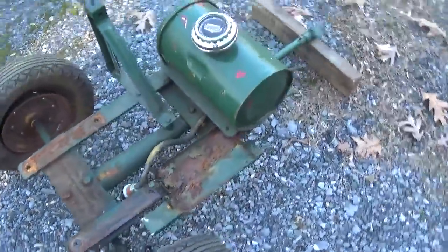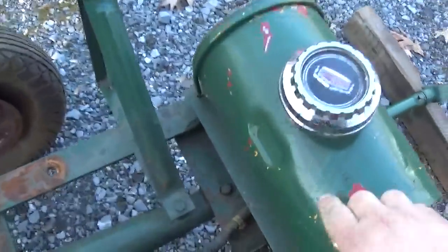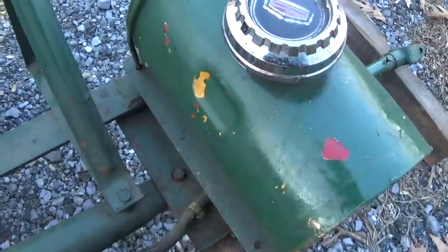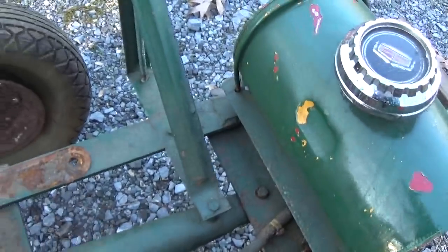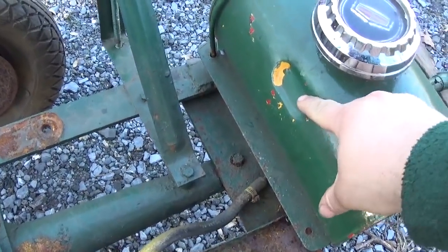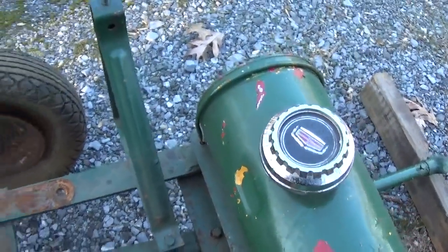The fuel tank, I don't know what the deal is with that. It's interesting that it has this little relief that's been stamped into it, and a kind of lousy paint job, but when the unit sits on this cart, this relief is actually necessary because the end bell of the generator would contact the tank otherwise.